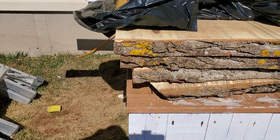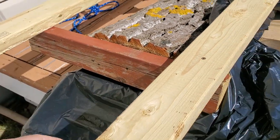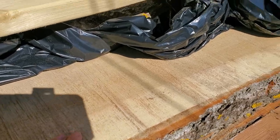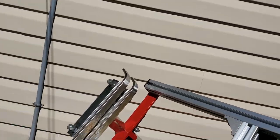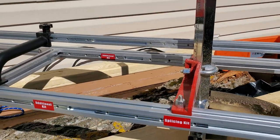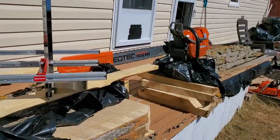This is really the biggest piece of wood I had to mill on the property. I used a standard method: I threw a little piece of two-by-four on the log at the end, then two more two-by-fours on top to make a rail for the very first cut. After that I just used the mill against the wood and away I went. They're not perfect — this is the first time I've ever done this and I was just playing around. I think this mill on Amazon was about $110, maybe five or ten bucks more than the other options.